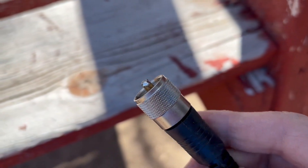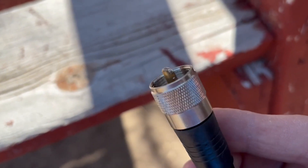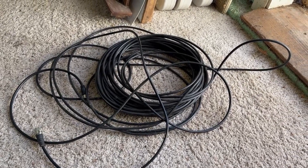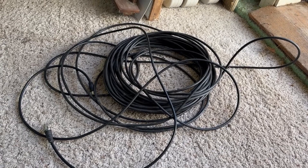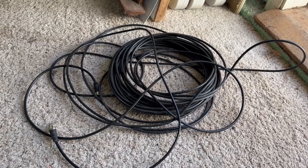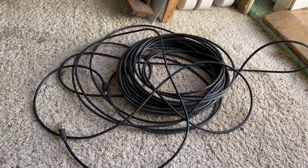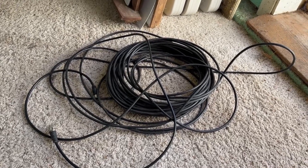What's interesting is the 100-foot cable — the old cable I bought as an Amazon return — had a loss of 7.5 dB, compared to the 100-foot run I currently have, which is good quality cable with only a minus 3.5 dB loss. So the old cable has twice the loss of the good cable I currently have hooked up.